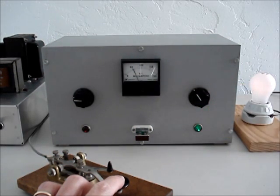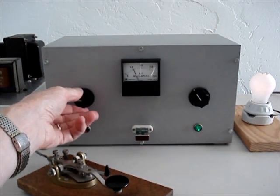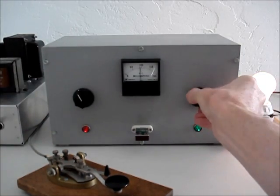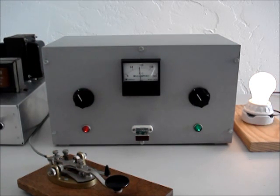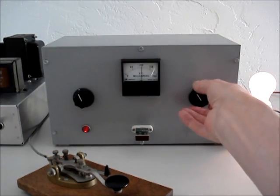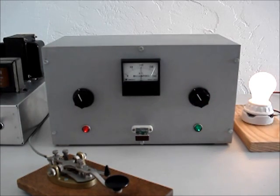It's around 50 milliamps, and you can see the light bulb just lit up. Now let's turn the antenna loading up. Dip again — there's about 90 milliamps, and the RF indicator light right there is lighting up now. And there's the 100 milliamps which is described in the article, and I've still got a pretty nice dip there.